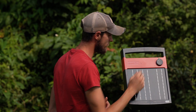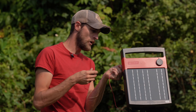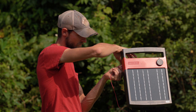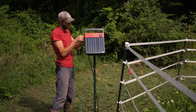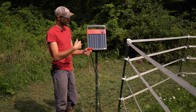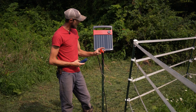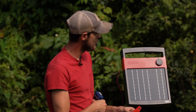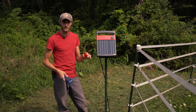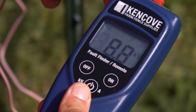We're going to turn the Energizer off and reconnect our lead-out wire right back into the positive terminal. While the Energizer is off, disconnect the lead-out wire from the fence — whether this is an alligator clip or a split bolt holding coated wire on high tensile wire, just disconnect that junction. Now when we turn the Energizer back on, we're still grounded and the only load on this Energizer is the length of our lead-out wire. When we make contact with our fence tester to the metal on this alligator clip, we'll get a good reading.